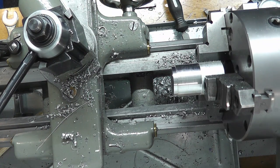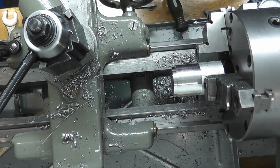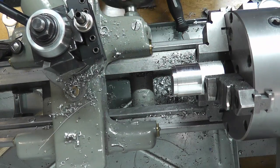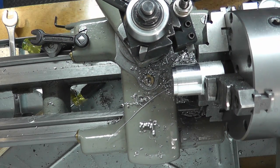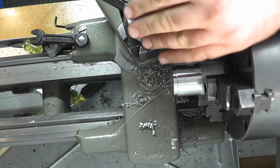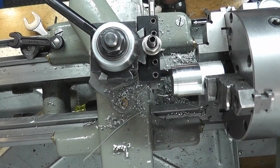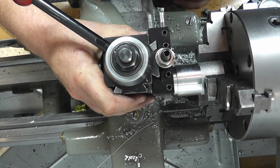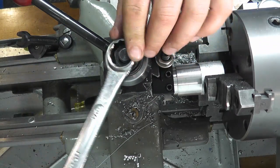We need to make the groove, which I had a grooving tool. There it is. Okay, so you just go ahead and square this up here. Just square this block up right against the edge of the work, because that's already faced nice and flat.